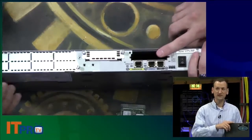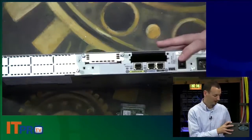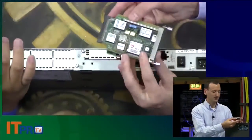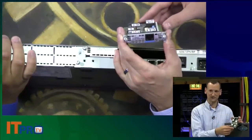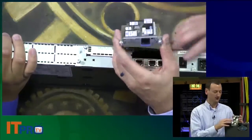This particular interface is what's called a WAN Interface Card, or WIC. The WAN interface cards are just these little guys right here, and you buy them based on what you need. This one, for example, is a T1 WIC — specifically for a fractional T1, not a full T1 — designed to allow serial communication.